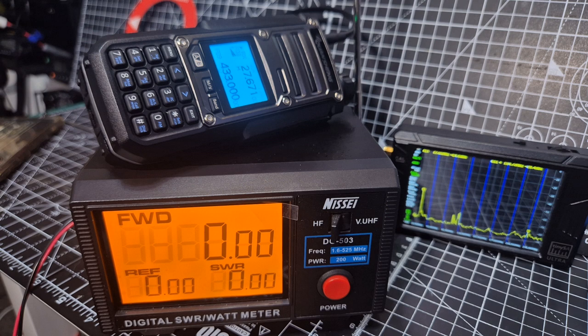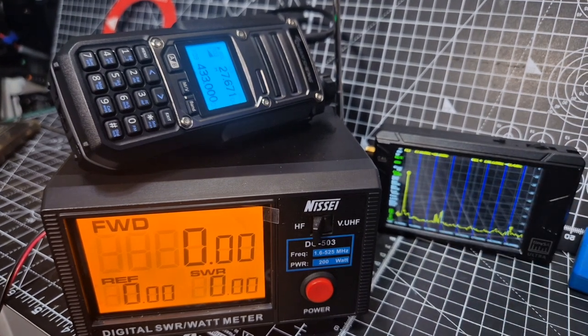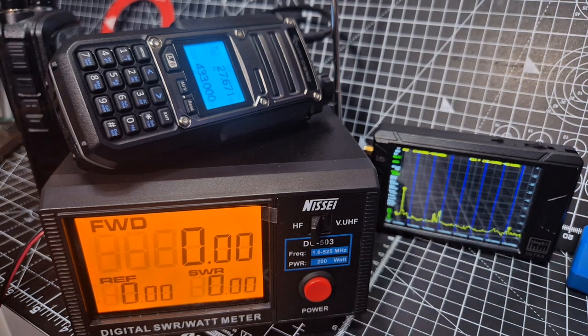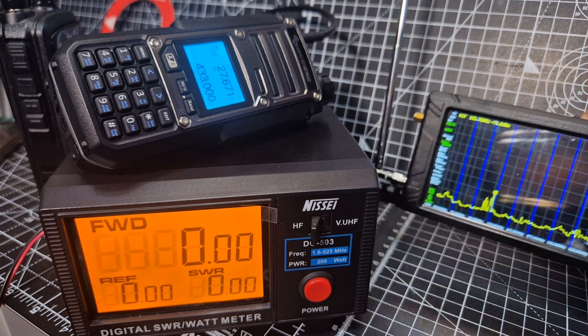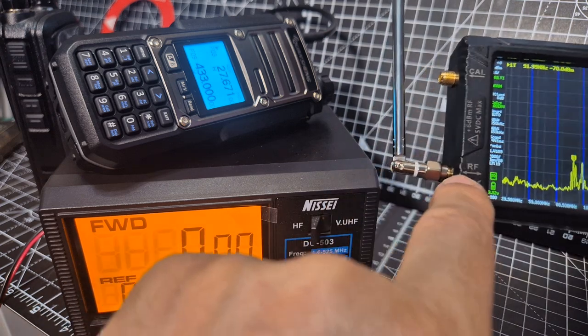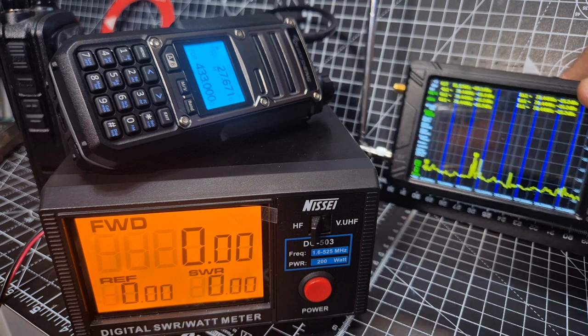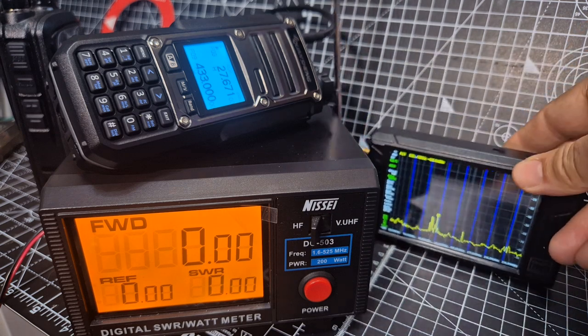Hamtech CB style. You can see the tester in the distance, and you can see the fundamental seems fine. Looking along the harmonics, to me they seem low. Now I'm not doing proper tests — I haven't got it going directly into the RF input because I haven't got an attenuator, so I'm just using that to pick up from the dummy load. But it seems fine to me.